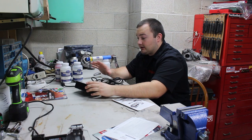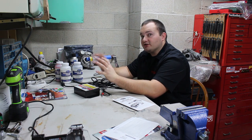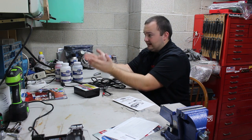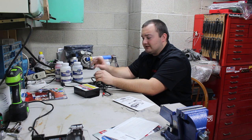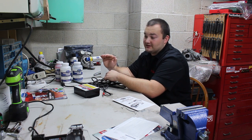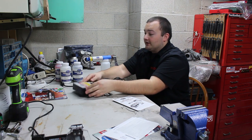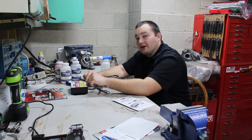This is a dual voltage gun. On high voltage it coats the object much quicker and covers a larger area. But when you get into small areas or divots, the electric field between the two angles doesn't allow you to get powder in there. So for tight spots you switch to low voltage, which coats slower but gets into the nooks and crannies really well. If it were only low voltage it would take forever; if only high voltage you couldn't reach tight spots — that's why the dual voltage system is so useful.